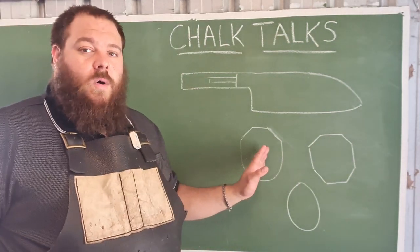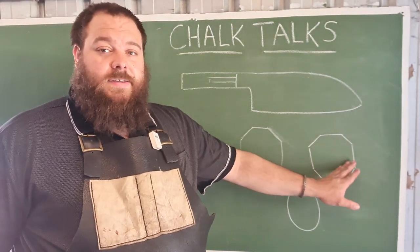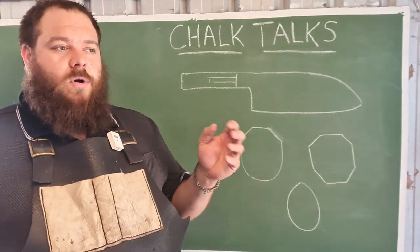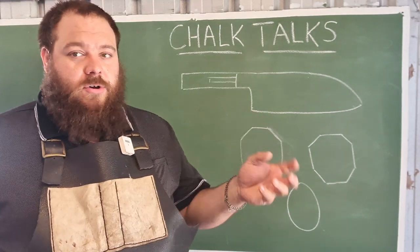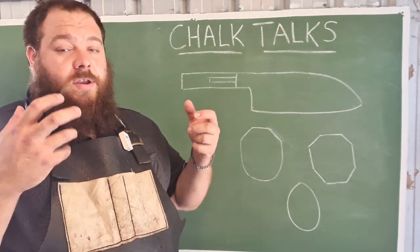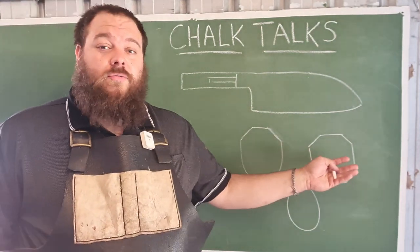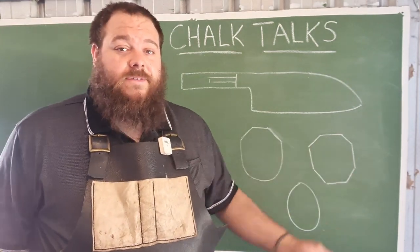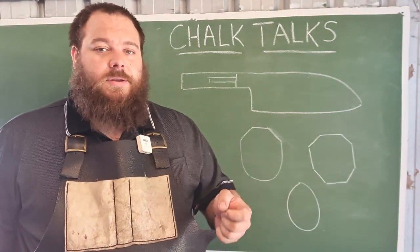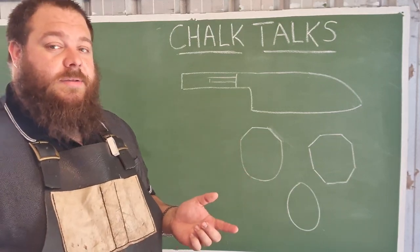You can do things like the very traditional WA or D-style handle, which is faceted at the top and rounded at the bottom. You can do a full octagonal handle, hexagonal, or an ovate handle. The difference in overall cross-section is actually going to inform the use of the knife — it's going to feel different in the hand and look different visually, especially if you're using certain materials that show through a really good grain structure with a faceted finish. When you start designing your handle, think about the cross-section as well as the profile. I think cross-section should come first.